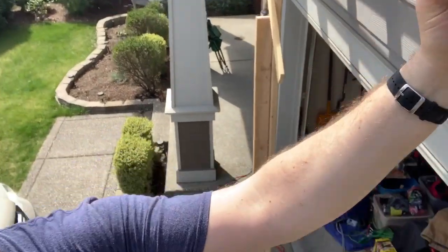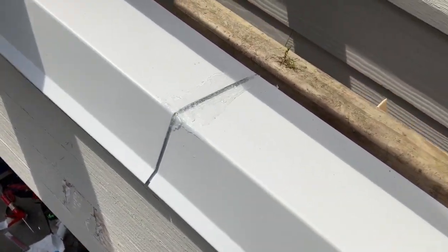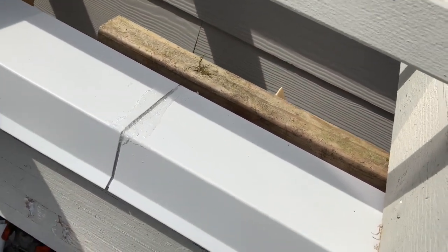This last one that I did, I couldn't back seal it. Let me take a look up here. It's not the ideal way to do this, I will say that. I acknowledge that. All you building envelope geeks are going to beat me up for this, but I did leave a little bit of gap for movement. I did use some sealant that is supposedly for gutters and flashings, and so it's supposed to remain flexible after you put it on. So I top sealed that one.